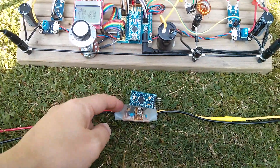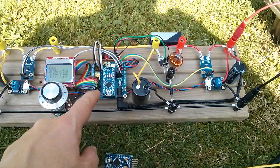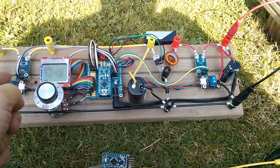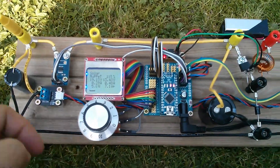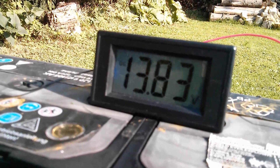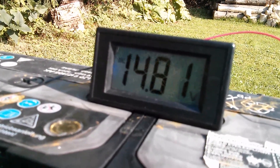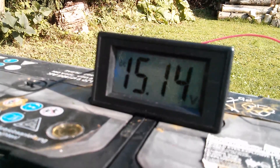Eventually the voltage maintenance algorithm in the PWM unit needs to be incorporated into the MPPT, because for this to be a charge controller it needs to control charging of the battery and not let the voltage go too high. For example, at the moment I've got the PWM set quite low — the battery voltage is 13.69 — but if I increase the PWM control and maximise power to the battery I can get the voltage to shoot up far too high. There it is, over 15 volts. So I'll back that back off.